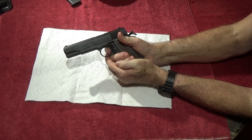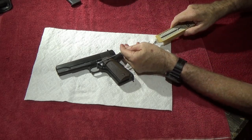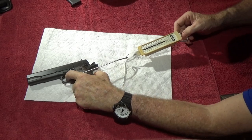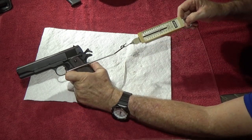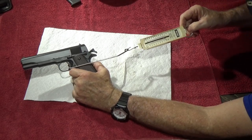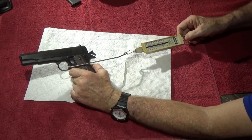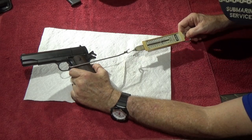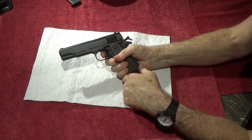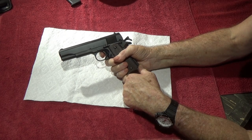We can actually weigh the take-up. Let me feel for it — stop right at the take-up point. That's a little over a pound. You can see it move right at a pound, just over — about a pound to a pound and a quarter. You've got to have at least a pound minimum or your trigger won't reset after you fire it; you want that trigger to come back forward when you let your finger off. So the take-up is about a pound and a quarter.